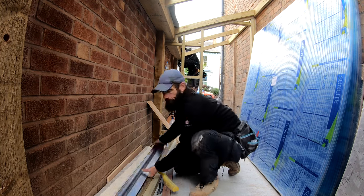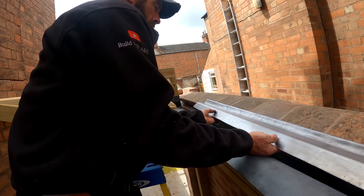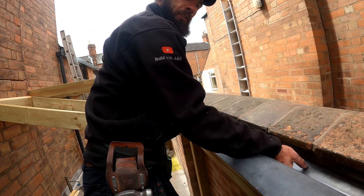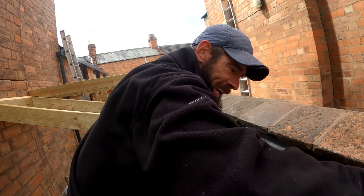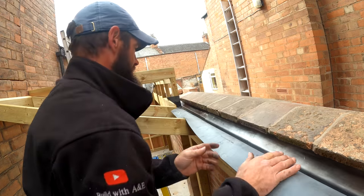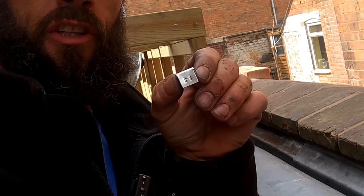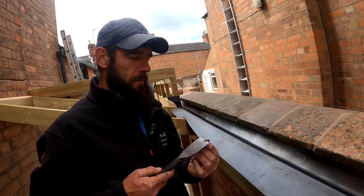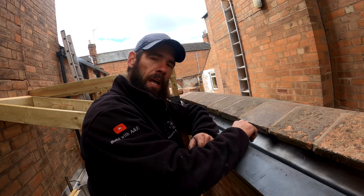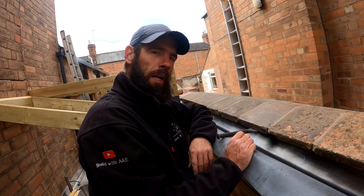Right then, let's get it up there. I'm going to show you now why I've moulded this lead ready to go straight away. We're going to get underneath here — it's a little bit awkward, as you can see. I normally use little lead clips. When you're putting them in, you put the H at the top — H for Hup. Normally use a bolster to get them in and tap them in. But because of the angle that we've got, I can't quite get that bolster in to get this clip in. If I did use the bolster and try to force it, the copings would pop or break off. It's just not good practice.